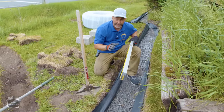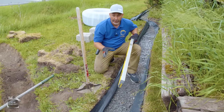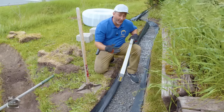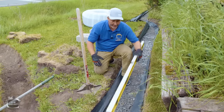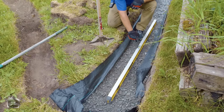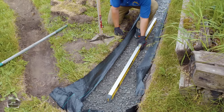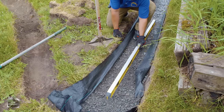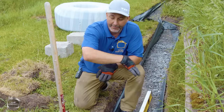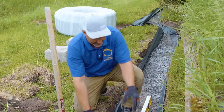I've seen a lot of people build these walls with really tiny levels — resist the temptation. A wall is a really long thing and you should use a long level. When I put my level in this dirt over six feet, I'm finding I'm really out of level, and that's fine. I want where my stone goes to be level, but behind it can be on a slope — that's not going to be a big concern.